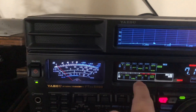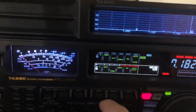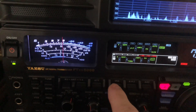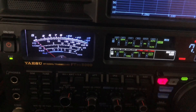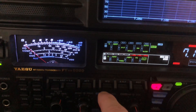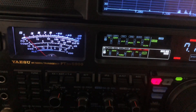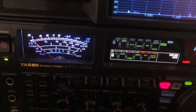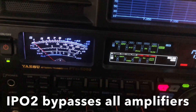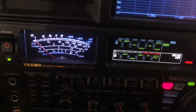Working that noise from the front end — as I've shown you many times on the channel — don't use maximum sensitivity on these bands. We've got Amplifier 1, Amplifier 2 — that's just way too much. It's going to drag in too much noise and degrade your signal-to-noise ratio. I would be able to pull them in with IPO 2. This radio has two levels of IPO. IPO 2 literally is no amplification whatsoever. IPO 1 is just a little bit of amplification, but it's optimized — hence the name Intercept Point Optimization — for signal-to-noise ratio. At the point where amplification would begin to drag in noise, they stop it.